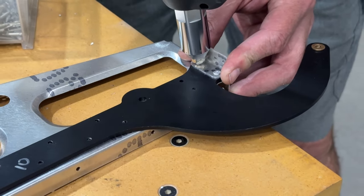I'm not able to do this while holding the phone at the same time, but once I get it, it lays flat up against the spar and all I have to do is pinch it up against the spar and tighten it down. I did have to add a shim — an extra little piece of Lexan — on this bolt here because as I started to tighten it up and checked for square of the ribs, it kind of wanted to pull out a little bit.